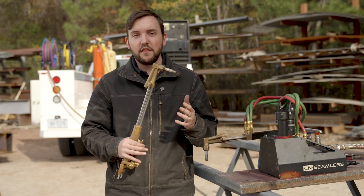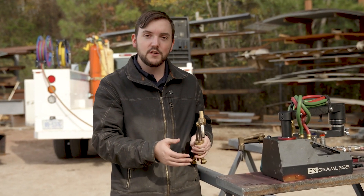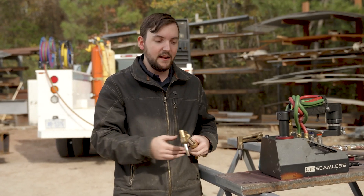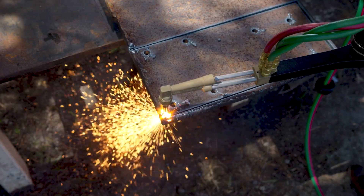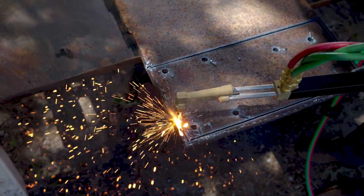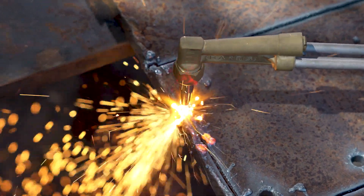When operating this torch, the weather, humidity, and altitude are all factors that play into how well your torch is going to cut through your material. Preheating is something you want to do before you get into your cut. It's a lot easier to preheat from a leading edge — if you're making a straight cut, start at your edge. If you're doing holes, pierce pretty much in the center so you can get your footing while working toward a nice clean cut on the outside or inside of your path.